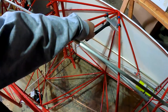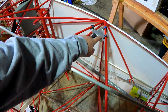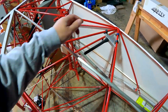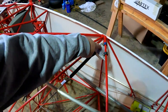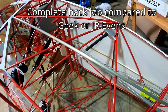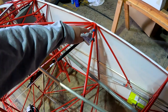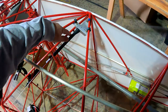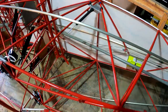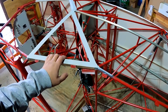One of the things I skipped — thought I had taken care of already — was the ELT mount. I had done this piece of angle right here with two Adel clamps and it was probably okay, but I wanted to add this third leg today, third clamp, and riveted that together. It's nice and strong. Now I need a coax cable about 30 inches long to go from the bottom of the antenna over to the ELT location — that'll be about perfect. Anyway, I'm going to heat up the hangar and get this piece of fabric on.